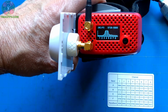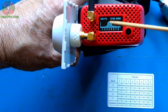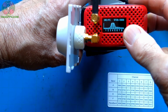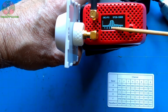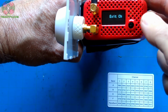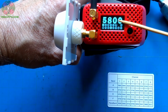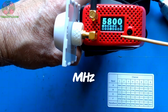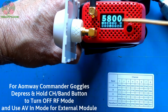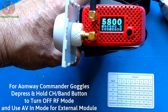Now, if I wanted to change my channel, which you saw previously was not on Fat Shark 4 on the module, all I have to do is to press the joystick. It goes to that channel. Move the joystick to the left to exit out, press down, and it automatically switches to 5800, which was the peak frequency that it was at when it detected the VTX channel using the spectrum analyzer. Pretty cool stuff, huh? All right, let's go take a look at our side-by-side comparison flights.